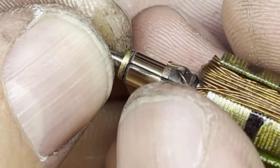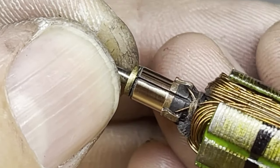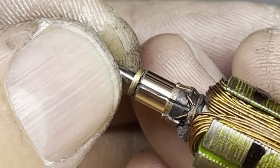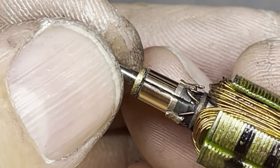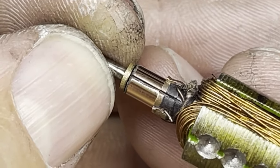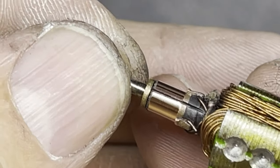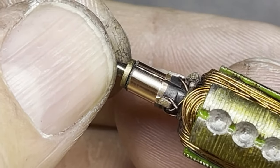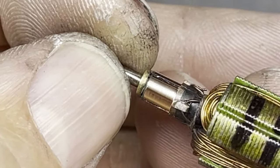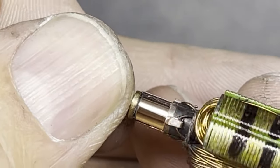It's not perfect — you can see the copper has still burnt away on the edges of the slot a little bit, so the slots are not perfectly straight anymore. That happens after a while unfortunately, as the copper burns away the comm slots don't tend to be that accurate anymore. But I can't true the comm down any further otherwise there wouldn't be any copper left. There seems to be a reasonable coating of copper all the way around the comm at the moment, so I think this armature is salvageable.